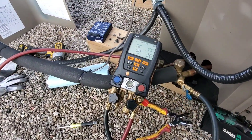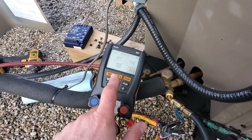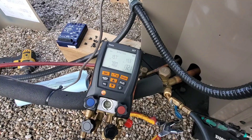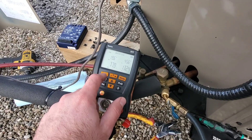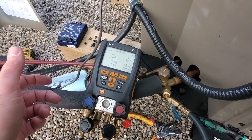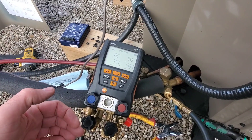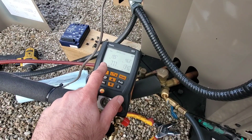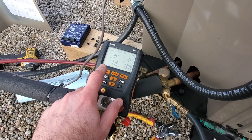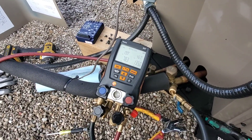Here are some results. The first go-around with the sensor where it was, we got down to 17°F saturation on the suction side — that's not good, that's gonna freeze up the coil. I took the sensor out, moved it lower on the condenser, and we're running with a slightly higher saturation temp on the suction side, but not much — this is still way below freezing and is going to freeze that coil up. I'm going to try one more thing and see what happens.